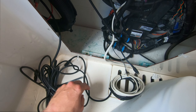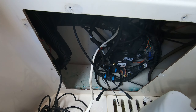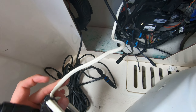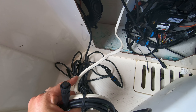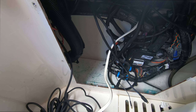I also have to cut off the original power supply that came with the GSD 22. This routes back into my fuse panel behind this hatch, and it already has the required 3-amp fuse in there. As you can see, that eight-pin is just not going to work for the new box, which needs to be a two-pin. So we're going to cut this off, save it just in case, and get the new power cable wired in. Once the new power cable is installed with shrink-wrapped waterproof connections, I'll screw the box in and get this thing going.